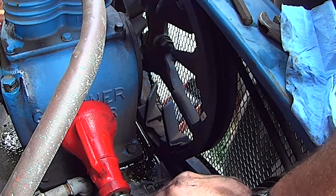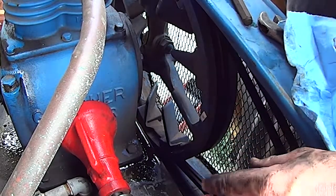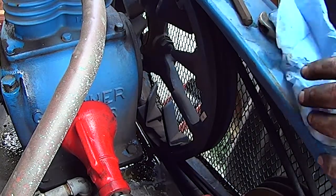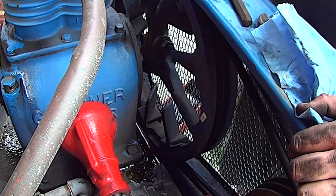I've got this little bottle jack in here, and I've got just the slightest bit of pressure to tighten the belts up. The important thing with this is to try to keep it perpendicular to the drive belts. I just put a tiny bit of pressure on here because it's easier than trying to reef on this with a pry bar or something like that.